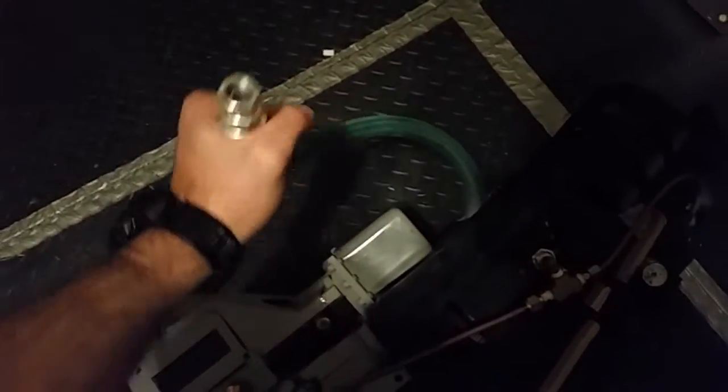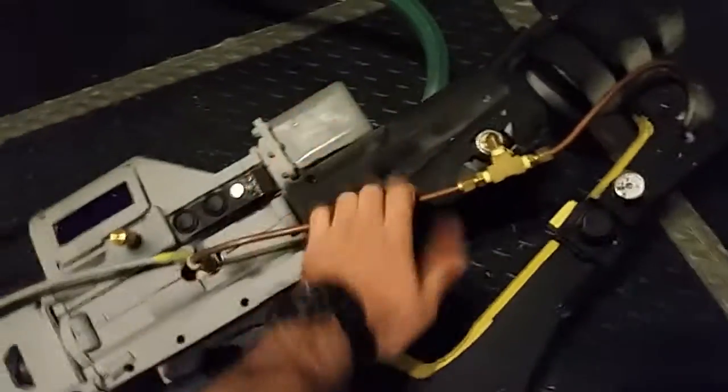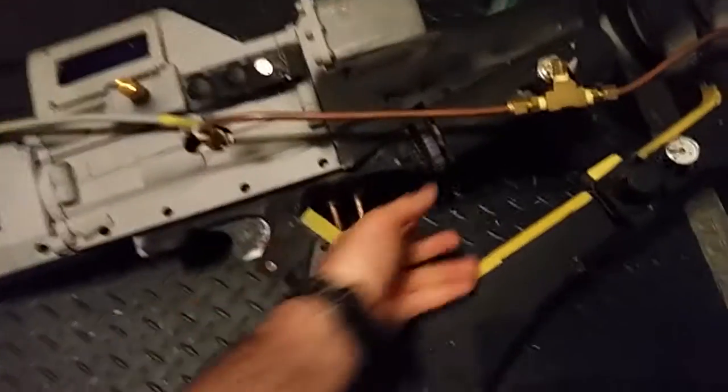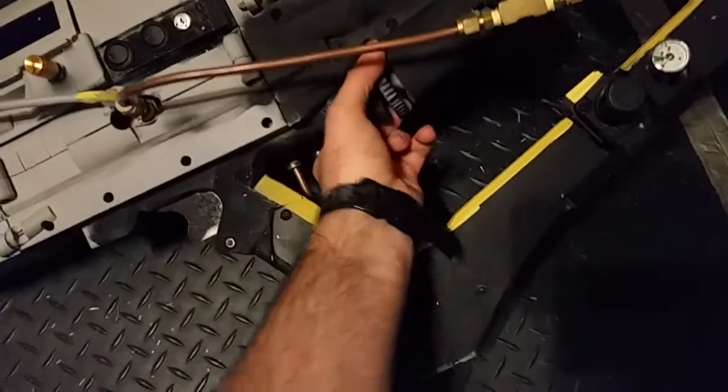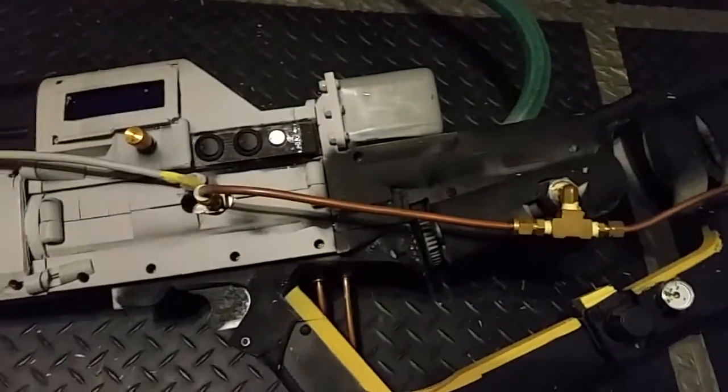I will take that apart shortly. And then this is the line that goes to the rails — this is also 1,000 PSI, but with a lot of flow. So this is a high flow, 1,000 PSI rated line. This is a low flow, 1,000 PSI rated line. And then the regulator down here, you can adjust that, although I think I'm going to get rid of the regulator because there's no reason to have this kind of a ridiculous regulator setup. It just adds weight and complexity.